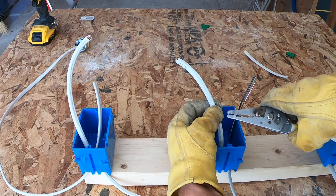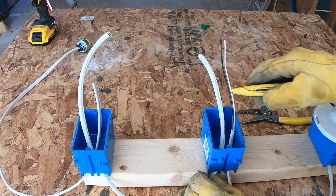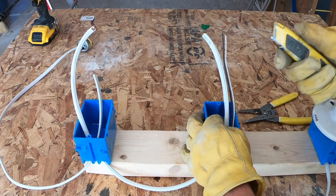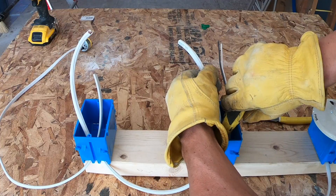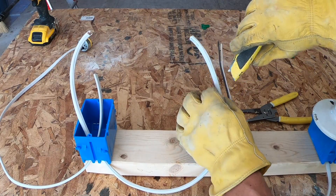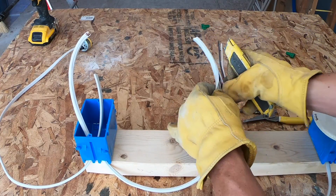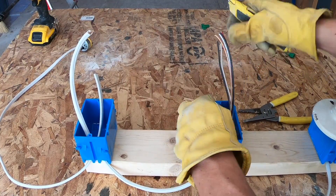This side we can't just use the wire strippers for because they will actually pinch the wires and we will nip open one of our hot wires or a neutral. We don't want that exposed. So when it comes to stripping this three-way wire, I want to make the stripped amount match this one. I put my blade out just barely and I lightly open this up. You don't want to push too hard because you're going to start scarring into existing wire. We need to get this open and get roughly the same amount undone.